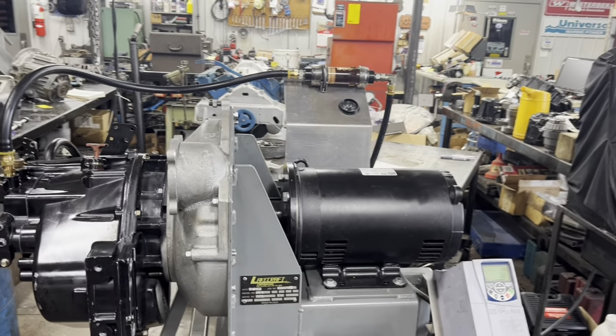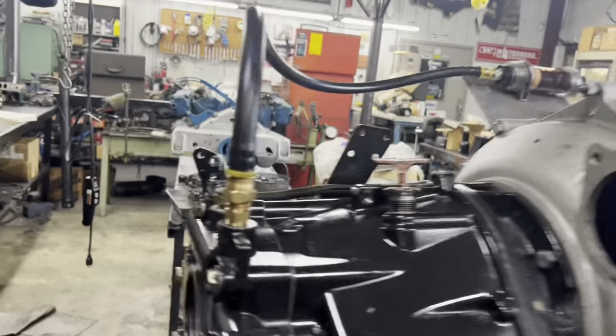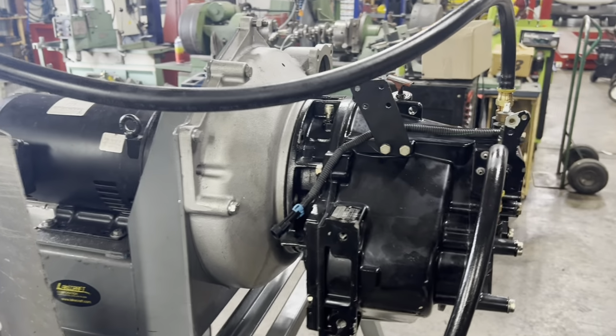Got it fixed up. Diagnosis using a cooler flow gauge. So I pressed that new unit into the lay shaft, resealed it, clutches were perfect, and she'll be fine. No more overheat and no more alarm.